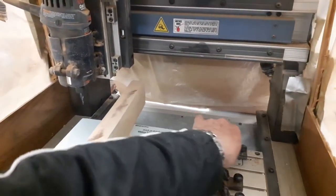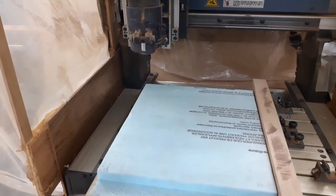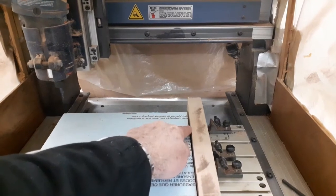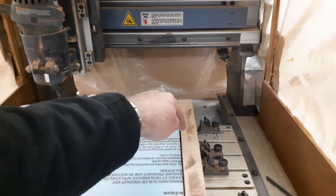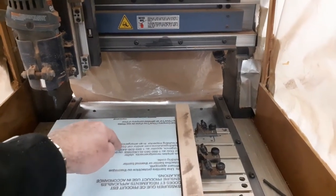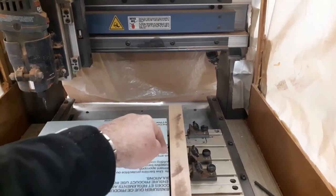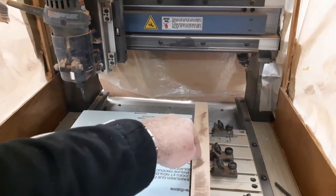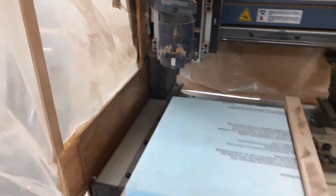This isn't the right size but I could put a piece of pine right here and set it up such that the bit traverses over, does its work, has a border, then in the raised position continues on until it kisses that piece of wood. That way, if during that pass it tends to pick up any buildup, it would clean itself. Then it would come back, dive into its work, raise for the border, come back, dive into its work, raise, kiss that side - each time cleaning the bit.